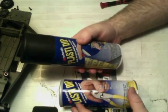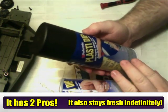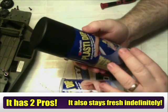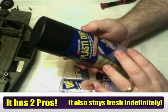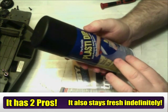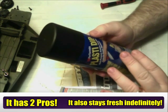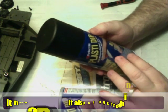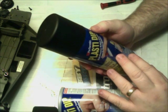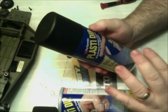The spray can also has one big pro and one big con. The pro to spray Plasti Dip is you get nice, even coatings — it looks very good because of the nice, even layers. The drawback is the coatings are very thin compared to the other two. So in most cases you end up having to do a couple of real good thick coats. The servo I'm working on now — which I'll be putting up a waterproofing video for — I just applied a second very heavy coat, and I think it'll have enough to call it done.